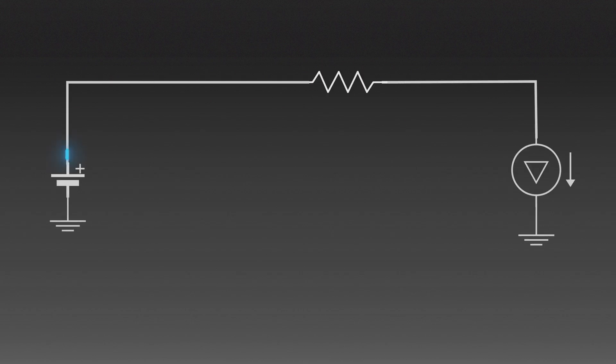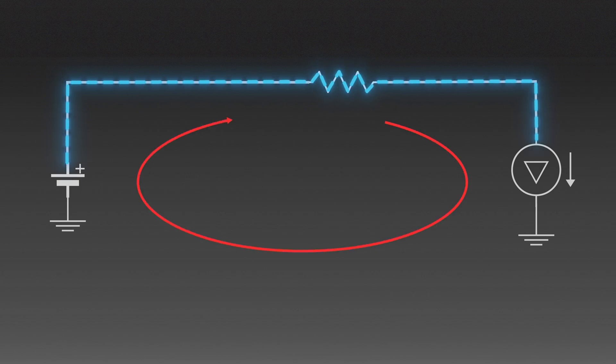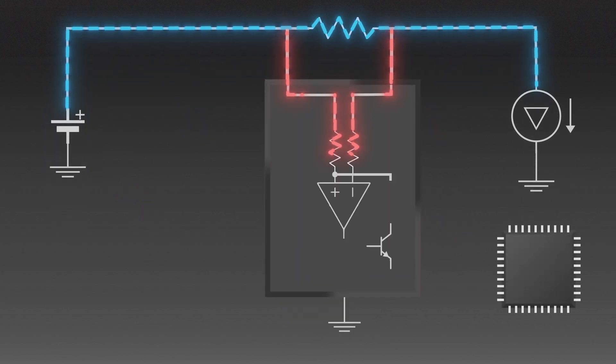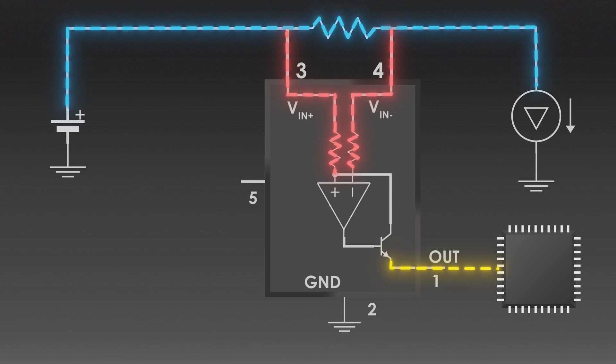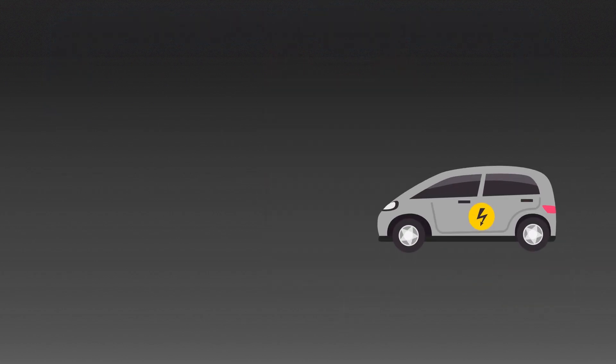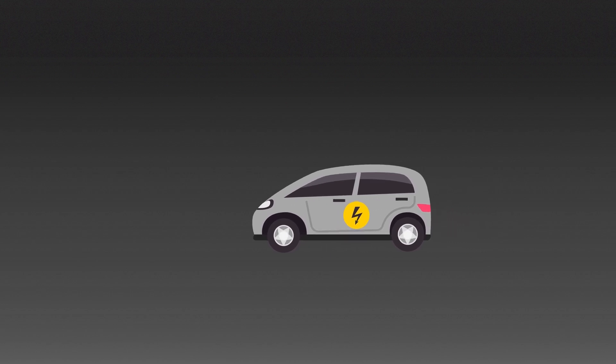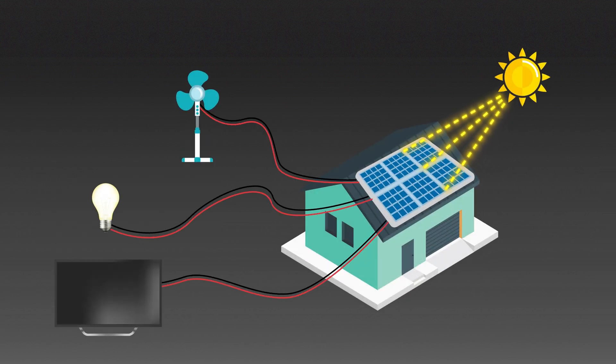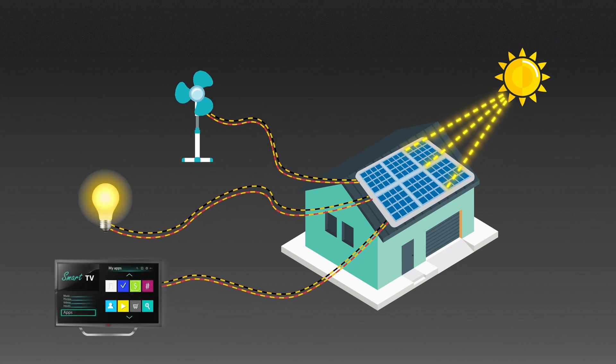The floating nature of this circuit isolates the current sensing path from the system ground. This minimizes interference and avoids creating unwanted ground loops, which can introduce noise or error, improving the reliability of sensitive measurements in noisy environments. The circuit's precise current measurements are converted to a proportional voltage, which can be fed into a microcontroller or control system. This feedback allows dynamic adjustment in real time — for example, in an electric vehicle's motor controller, which can adjust torque based on the current supplied to the motor, and a solar inverter can optimize power output using maximum power point tracking.